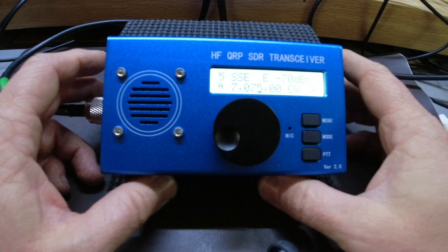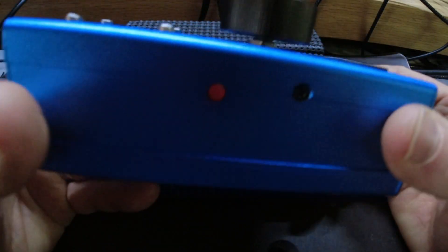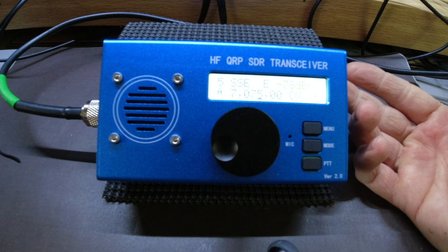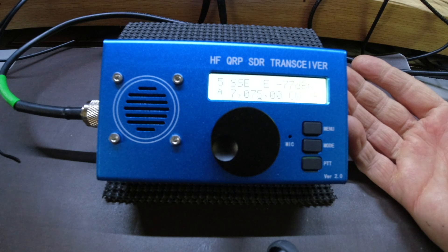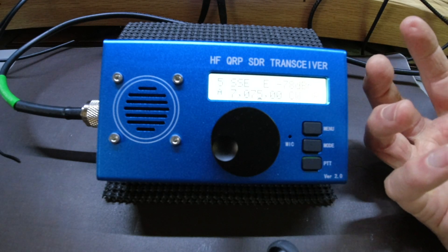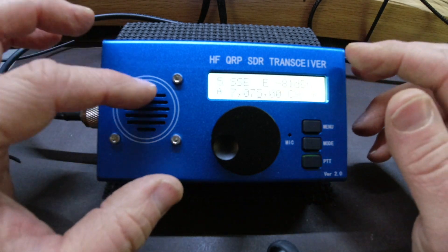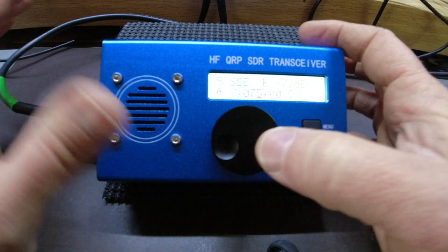I would encourage you to spend a bit more instead of getting this radio as cheap as it is. Or if you're getting it just for experimenting, plan to crack it open and change some things, because as-is I would never take this to a summit. Sometimes when you're on a summit and the stars align, especially in CW, you can have a pretty big pile-up, and I really don't think it would be possible to operate a pile-up on this. I also don't think you could operate this on any day with a lot of signal density, say during a contest — I suspect this will overload. The receiver very easily overloads. And again, when I took this to Vlado's, the first thing he noticed was how raspy and distorted the audio is.